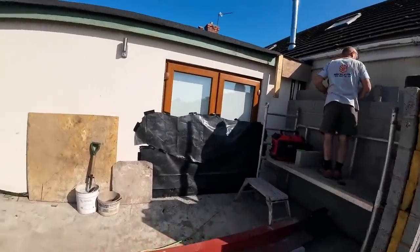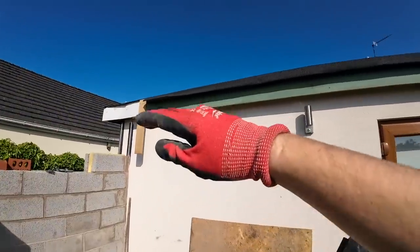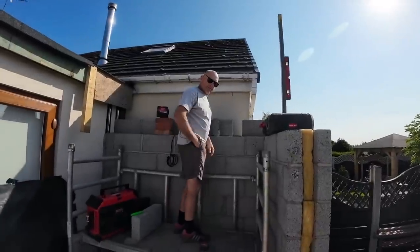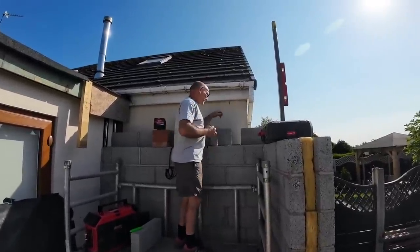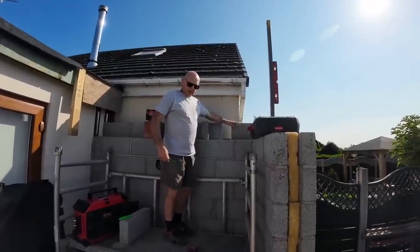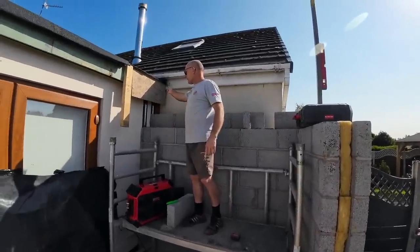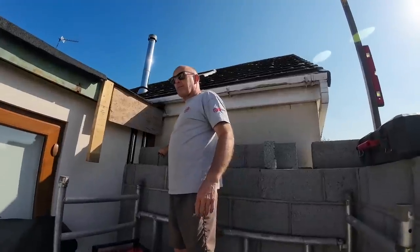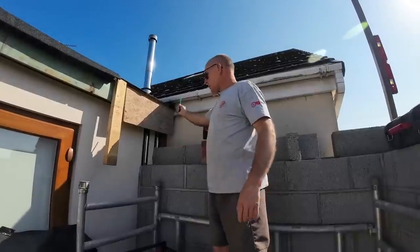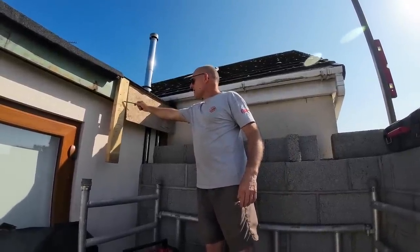I think all that's left now is from the top course a block and a 150 cut, I think. All we've got on the top is a 75mm cut. Oh, right. I think. No, it's not, because the outside comes up. The wall plate goes on the inside. So this block work's got to come up yet to, I think, to the top of steel. Close to there.